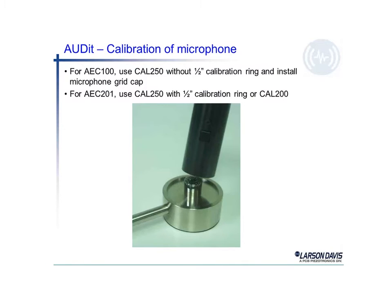To calibrate the audit system, everything is referenced to an acoustic calibrator. In this case, the model CAL 250 is our reference. We place that over the microphone. There have been a few users who attempt to set the CAL 250 on top of the one-inch mic because there's a calibration adapter in the way. The user needs to remove the calibration adapter — the half-inch adapter ring needs to be removed for the CAL 250 to fit down over the one-inch microphone. There's about a 10 dB error introduced with that scenario.